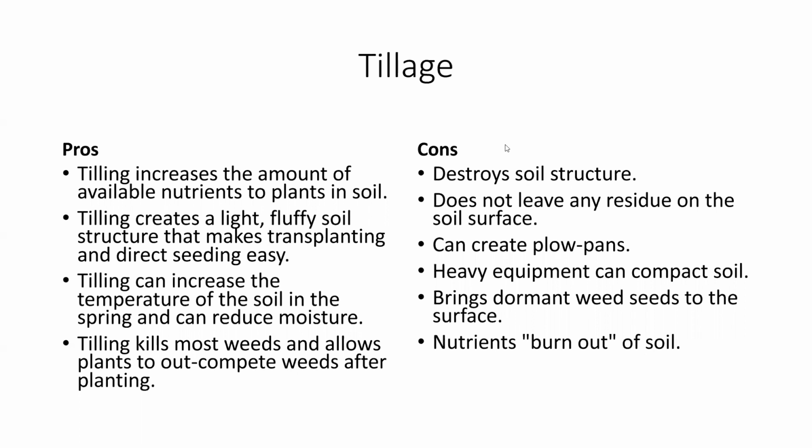Tillage, we can imagine that we've got this basically big spinning blender device that's spinning vertically in our soil. And that's tilling up our field and creating a great soil structure. But at the bottom end of that tillage implement, that implement is actually smearing the bottom of that soil, wherever the bottom of that tiller is hitting. It's actually sort of smearing it out from the weight of it and the action of it spinning so quickly, or spinning actually at all.